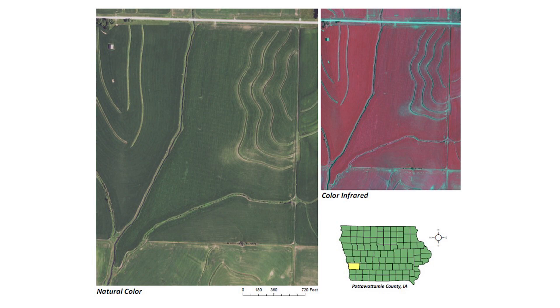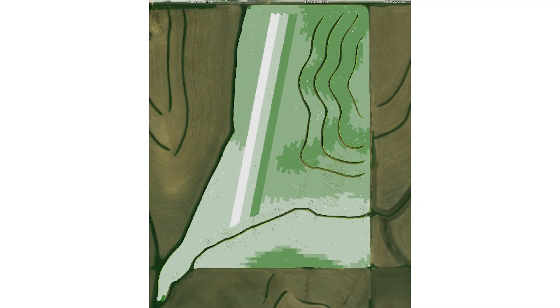We did this on a field — again, the last field of soybeans that I planted, a fairly flat bottom in Pottawatomie County, southwest Iowa. What I did was take the rate and go above and below where I thought it should be. I planted three passes at 160,000, then cut the rate to 120,000 for three more passes, then cut all the way back to 80,000 for three more passes. With a 12-row planter, I wanted to plant three passes to make sure we collected quality data. Knowing we were going to come in with a 35-foot head, one pass wasn't going to do it and two passes didn't leave a lot of room for error.